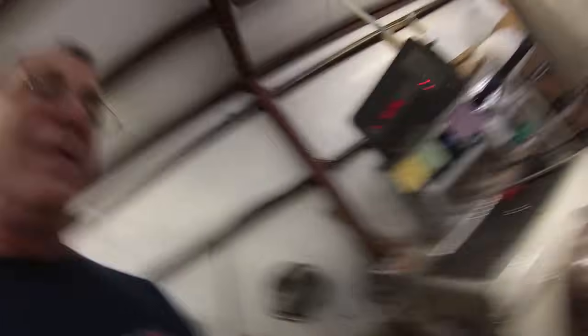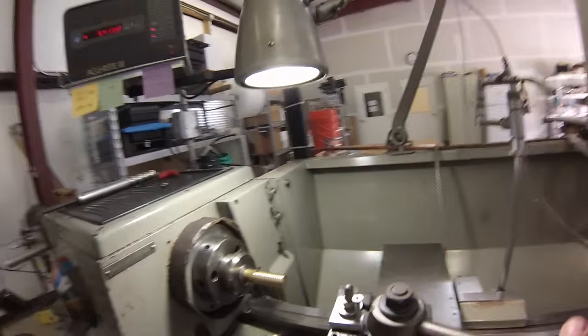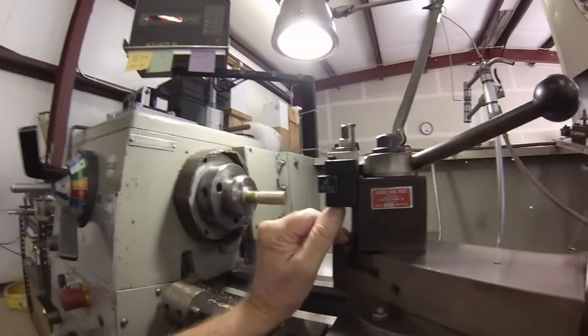Most guys are going to say set the compound at 15 or 30 degrees, whatever. If you're plunging with carbide, go straight in — it doesn't matter what it's set at. I'm at 23. I'm going to back it out, go back to my stop, back into reverse, tool going back in the undercut. Look at that — hands off, still moving, no panic, no nothing. If anything gets excessive with the load on an inverted tool, it lifts. It doesn't snap off, it lifts. Also a good way to run a huge form tool — upside down works really well.